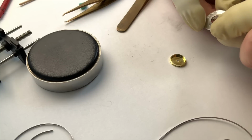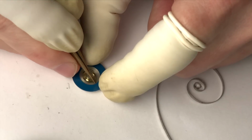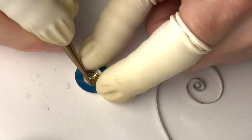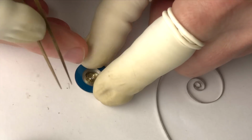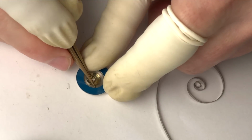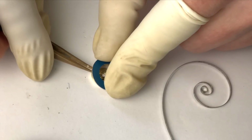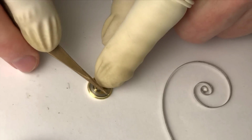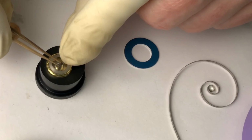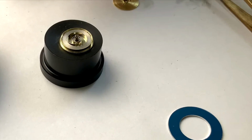As I was saying, the mainspring was broken at the tail, so it would probably sometimes wind rather erratically. It might run for, who knows, maybe an hour, a few minutes, all depended on how it would grip without that tail. So got our new mainspring here, and I'm working to make sure it's all seated fully, being very careful so that it doesn't spring out.